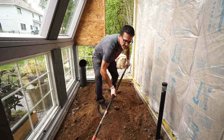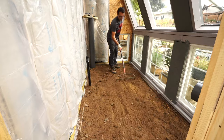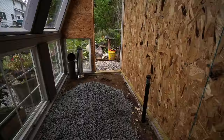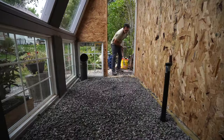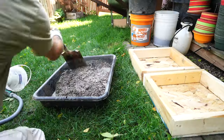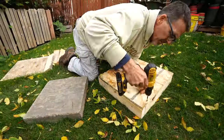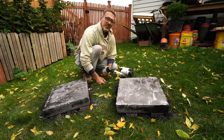It was time to backfill more sand to level off the PSGF floor. After that, I added a quartz floor to keep dirt from splashing up on the windows and walls. Then I started constructing foundation blocks to put under the cement pillars. All this cement would hold heat with thermal mass in the PSGF, hopefully holding on to a few more degrees on cold winter days.